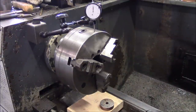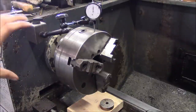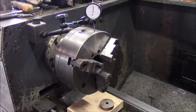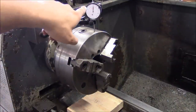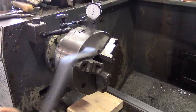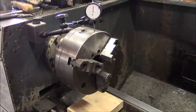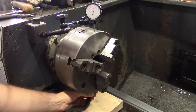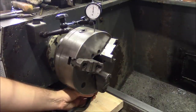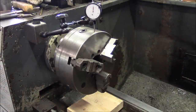The first thing I want to eliminate from the bad surface finish equation is the spindle bearings. This machine has a double set of straight roller bearings at the front and back, plus a double thrust bearing at the front — that should be a pretty rigid setup. I've got a 1 thou indicator on top of the chuck, a piece of wood across the ways, and I'm going to use a pry bar to see if we get any movement. Maybe half a thou with about 50 pounds of pressure on the bar — I don't think that's a problem.